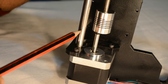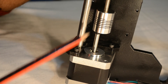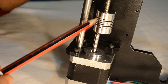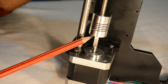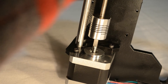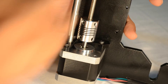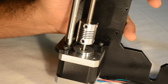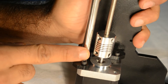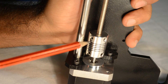The shaft of the motor should be parallel to the Z axis smooth rod. Now we shall couple the M5 threaded rod and the shaft of the motor using the coupler already installed on the threaded rod. Align the coupler with the shaft and slide it down onto the shaft. Ensure that at least one set screw is on the flat of the motor shaft, then tighten the set screws.